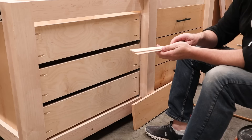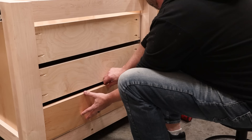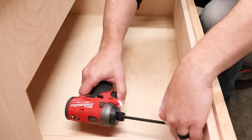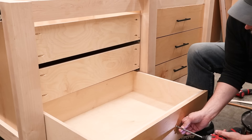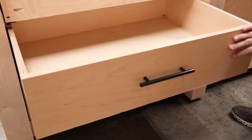With the new assembly table in its place, I have a lot more breathing room and I can go ahead and add the finishing touches to the base cabinet, starting with the drawer fronts. Since these cabinets are inset, I can add spacers to the bottom rail and position the drawer front where I want it, then fasten it to the cabinet using the holes that I made for the pull. Then I can fasten the drawer from the back side before removing those two screws and drilling the holes completely through. Then I can just install my drawer pull and do that same process two more times.